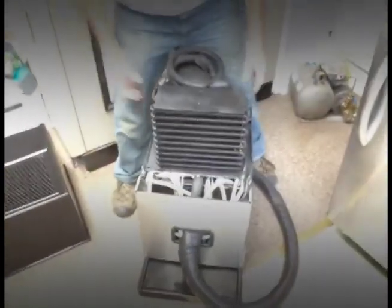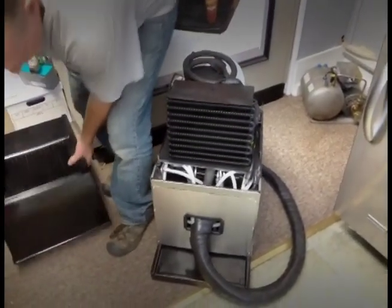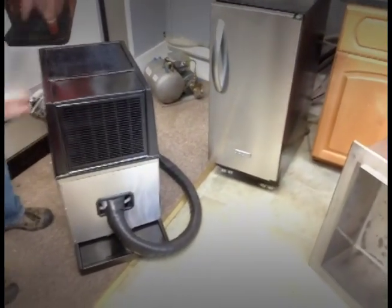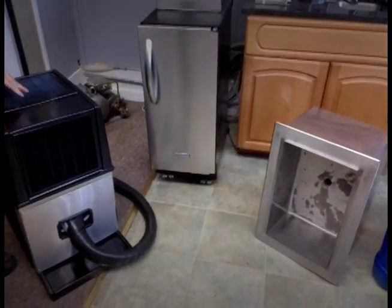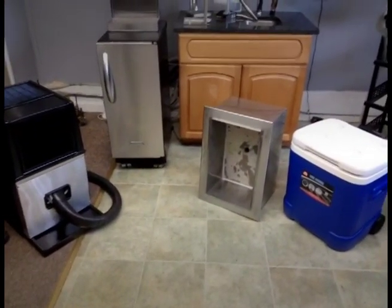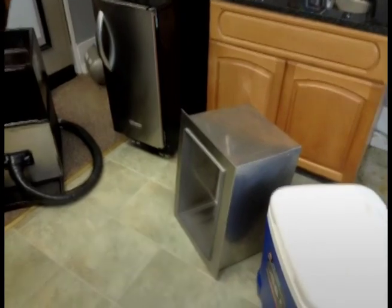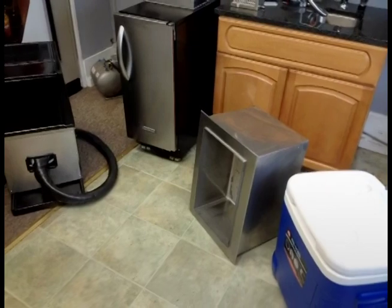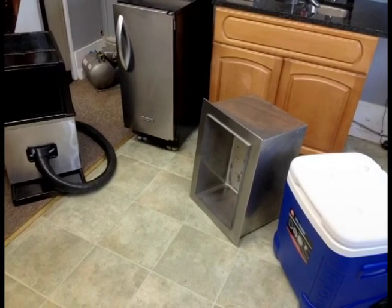This is one of the easier systems, like the ice under-the-counter ice maker, in that you can basically plug and play and it does its own thing. It shuts off when it makes a block of ice, and when you start using it and the ice starts to shrink down, it reforms on its own and then shuts off again. It doesn't run continually — once it fills up, it shuts off. These systems need to be within five to six feet of your dispenser, as you would otherwise lose temperature in the tubing run. These are the most common ways to cool your soda fountain system using a cold plate or remote cooler.